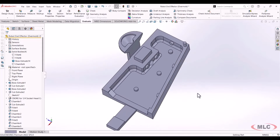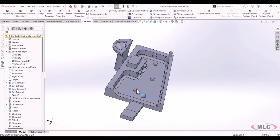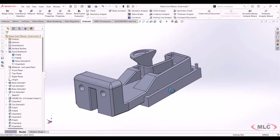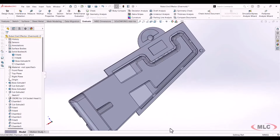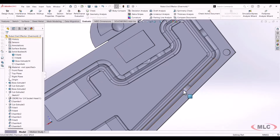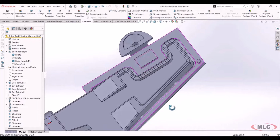Okay, probably the first thing you'll notice is all these little pips here, all these little dowels that extend out. And what this is doing is it's just centering this. You can see these come out, and it's less than half a millimeter gap here. It's like 0.2 millimeters spacing between all of these, and they help center it inside, and just prevent any wiggling or anything.